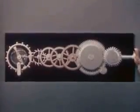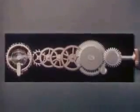What we have now is a complete model watch train. Through the gears, the mainspring drives the escape wheel. The escape wheel teeth push first on one pallet jewel and then the other. The pallet fork nudges the jewel pin on the balance wheel to keep it moving. The swinging balance wheel on its return trip moves the pallet fork, which unlocks the escape wheel to release a little more energy from the mainspring. Back and forth the balance wheel swings, controlled by its small coiled spring — the hairspring — in perfect rhythm.